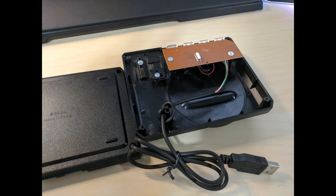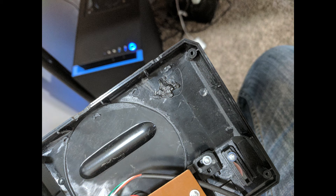The first thing you'll notice is that there is not a lot of stuff inside. Other than the PCB board, there is just a USB cable looped around a little peg that we'll have to deal with in order to fit in the Raspberry Pi. I could have used a file on the post, but it was faster to just heat up the peg with a soldering iron and erase it off the board. Inside doesn't look quite as pretty, but it was much easier than grinding away at that tiny little plastic peg.